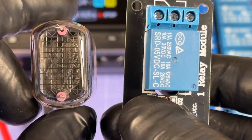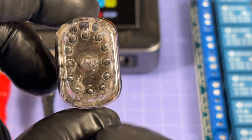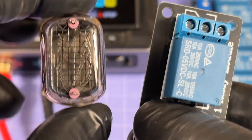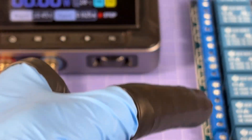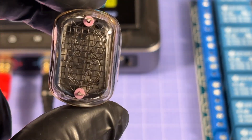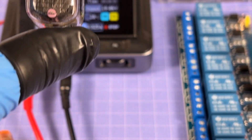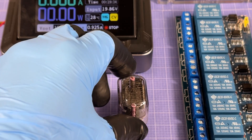The plan is relatively straightforward: the anode pin connects via the resistor to the high voltage positive, just like before. The normally open pin on each relay connects to one of the cathode pins on the Nixie tube, and the COM pin on each relay has the high voltage negative. If everything goes to plan, we should be able to control the high voltage Nixie tube with a low voltage Arduino.